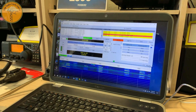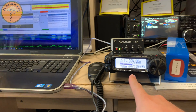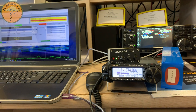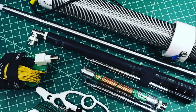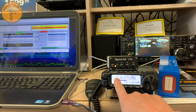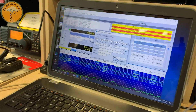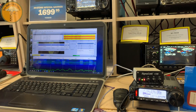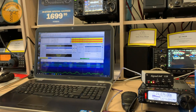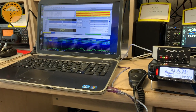I didn't know you could do that tuning thing — that's pretty sweet. So why you need to do that is for this radio, since it doesn't have a tuner. But if you're using something like a Wolf River coil antenna, you hit that tune button, have this thing set to SWR, check your SWR reading, turn the tune off, go adjust the coil, come back, check the tune, go back and forth until you get it right in tune, and then you're good. You can do that with AM too — anything with a carrier tone.